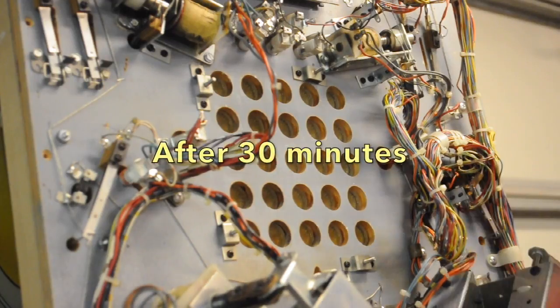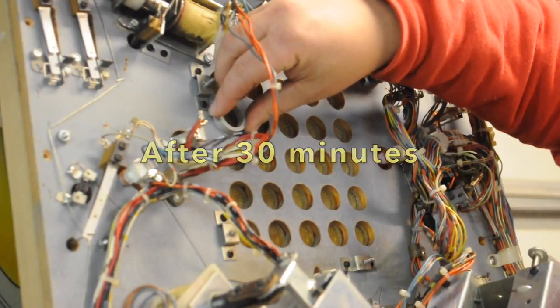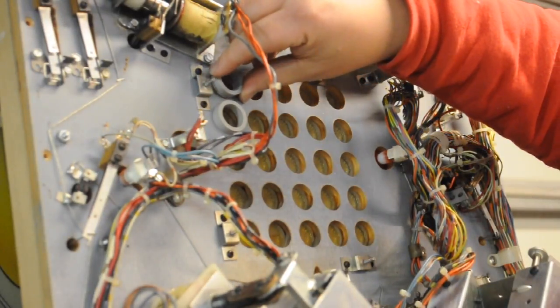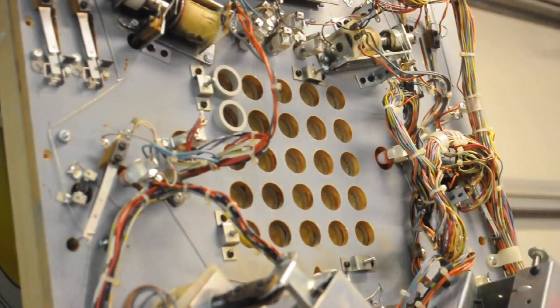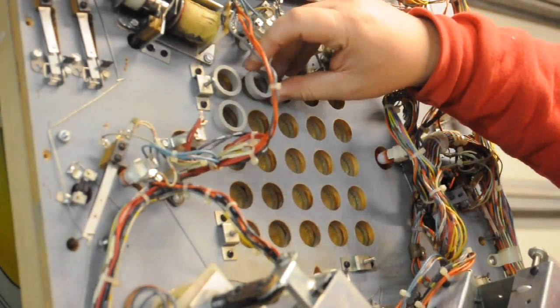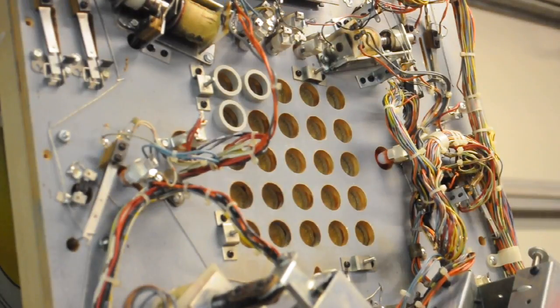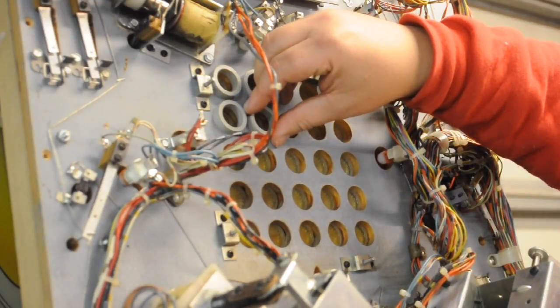Wait about 30 minutes to allow the rubber cement to dry before attaching the isolation tubes to the rear of the playfield. The isolation tubes are about 1/16 of an inch smaller in diameter than the inserts. You won't notice that from the front side. Also, there's about 1/8 of an inch clearance between the tubes and the LED Pac-Maze board so that they don't run into each other. I wouldn't recommend trying to attach these isolation tubes to the board. You'll have a gap on the board side and you'll still have bleed over.